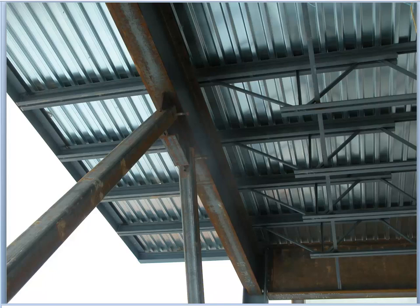This shows an installed version of the decking. The decking spans across the roof trusses, with top chord extensions supporting the overhang. This decking can span in one direction only — it cannot span perpendicular to its corrugations; it's extremely weak and flexible in that direction. So there's a need to support it all the way out to the edge. That edge will typically have a turned-up angle on the outside, providing additional stiffening and a way to mount fascia elements subject to wind.